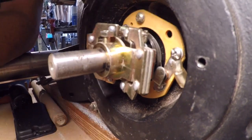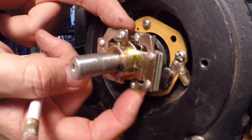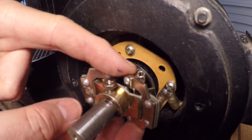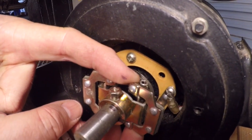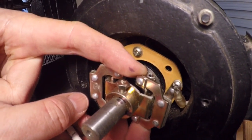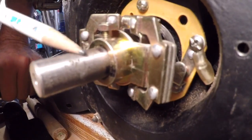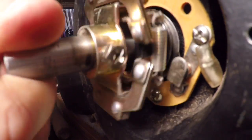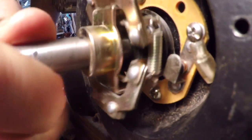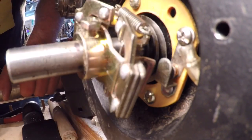But then when the motor fires up and runs, this centrifugal switch — the weights come out — and what it does is unload the points and change the position of the contacts, taking the capacitor out of the circuit. What we found was that when we took this apart, everything was nice and tight, but when we turned the shaft around, there were positions in the rotation where the contact was not made up for the capacitor.